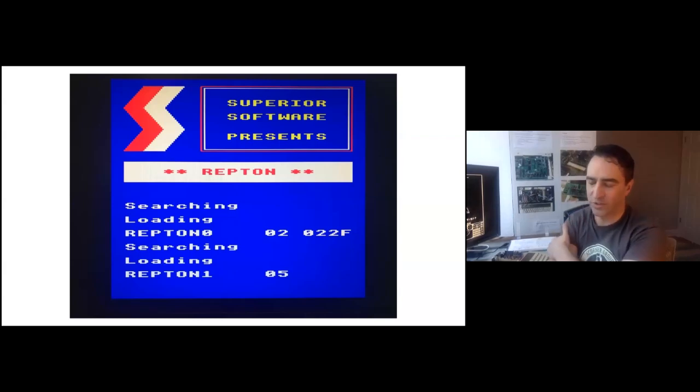QPI flash I believe that one worked — it was easier to get working than I thought. It's a relatively complicated protocol, but I managed to drive it at half the FPGA's clock rate. The FPGA runs a 96 MHz clock, but weird stuff happens when you try to do external interfacing at the actual FPGA clock rate. So I did all the interface at half the clock rate — 48 MHz — and that works just fine. I also got I2S working — the audio output. I thought I2S was some complicated protocol, but actually it's pretty simple compared to most of the memory interface stuff I was going to have to do.